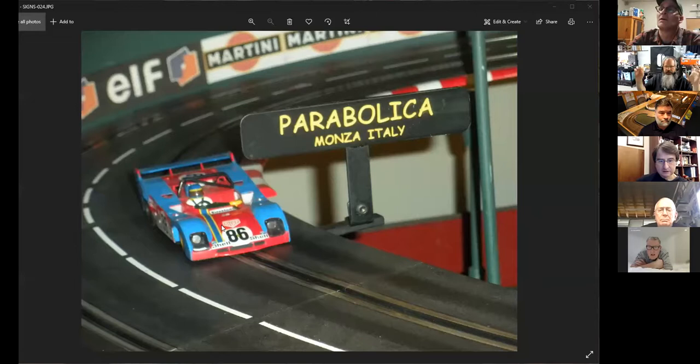So cool. Once I get it mounted, and I'm going to print all of the mounts an even size, they have threaded screws in here so I can screw them all down. And then, once I go into the software, what I did to do this was I took a 9-volt battery, which weighs exactly 45 grams, as my test weight. I tested it, and then in the software I was able to adjust up and down to get it to zero. That way all four scales are zeroed.